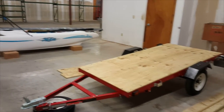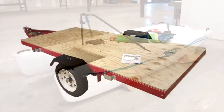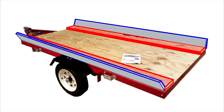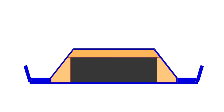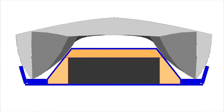Once we get to this point, it's time to think about a design for the upper deck to adapt it to the Hobie Bravo. A logical design would have gutters for the hulls to slide onto and outboard rails. Taking advantage of the space between the hulls, we can make a storage area the full length of the trailer. Those rails are installed at a 15-degree angle, so that when you slide your catamaran onto the trailer, it'll sit firmly in position without being crimped.